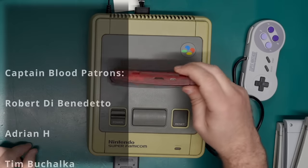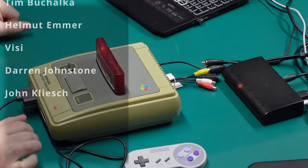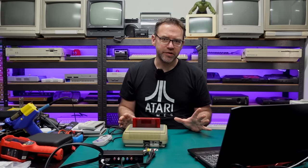Let's just start out with the EverDrive, so I'll chuck this in. I've got this hooked up by composite video at the moment, and we can see that the image looks pretty terrible. The brightness is all out of whack, there's some weird horizontal waviness to it, and we've also got some random vertical lines appearing. So that tells me there are at least two issues going on here.